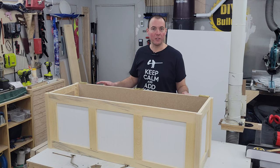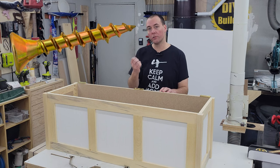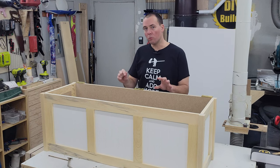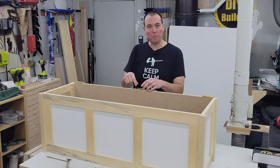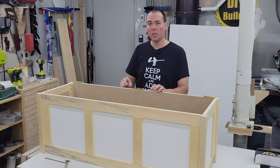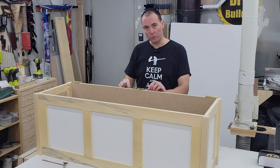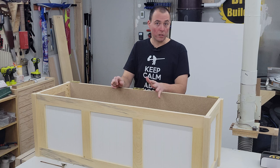We can move on to getting the hinges mounted. I have one in the center and two on the outsides, and we're going to be mounting them with these one inch construction screws. I'll use my self-centering bit and then come back and drill these all the way through with a pilot drill, as you don't want to split this end grain MDF. Now you can go ahead and mortise or rabbet these hinges a little bit into place so they're nice and flush, but in this scenario we actually don't want to do that because the thickness of the cloth wrapping around means we really want that extra bit of distance, otherwise it's going to be kind of spring loaded and the lid won't quite close properly.